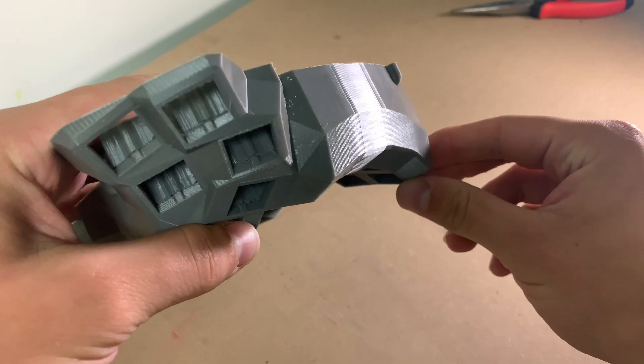It turns out that soldering is really boring to watch — good thing I'm super quick at it. After making sure all of the switches worked properly, I hot glued them in because I would potentially want to pull keycaps off this thing, and if there were diodes soldered behind it I really wouldn't want the switch getting pulled out as well. This keyboard is hand wired which means I need to solder wires to every single row and every single column of the matrix. I'm putting the diodes on the rows so I'm doing the columns first with insulated wire so they're all out of the way.